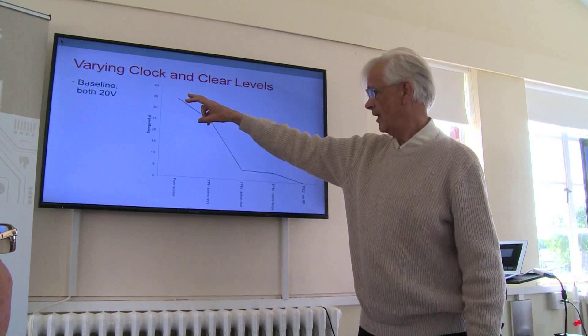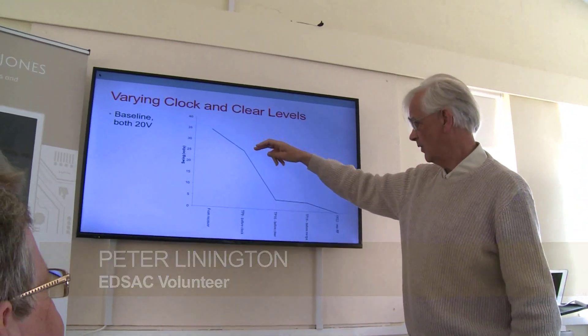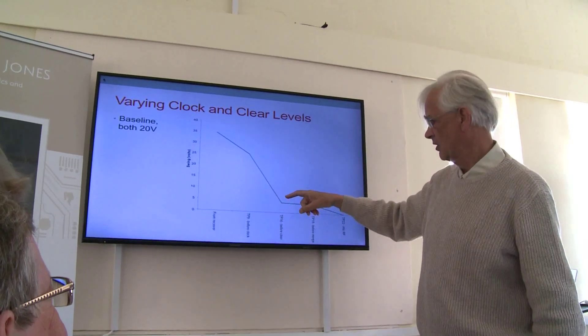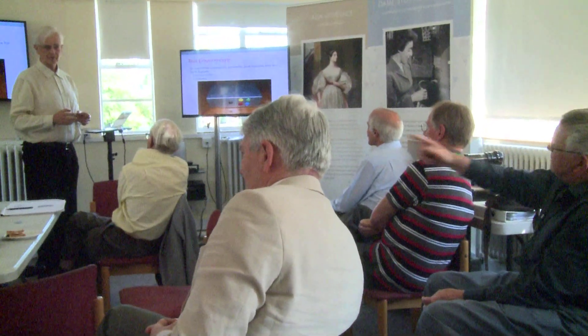About 35 volts coming out of the preamp. It drops. The first stage of buffering, it drops a lot. I've just had to move out of the room because we're making too much noise in the workshop. Most of the problems this morning really are to do with drift and with the size of pulses, which you get very high attenuation on these old circuits.